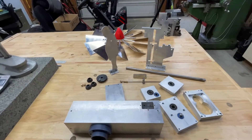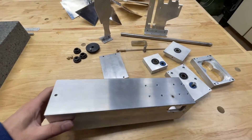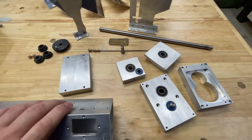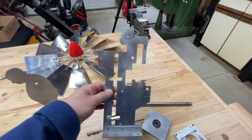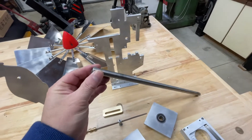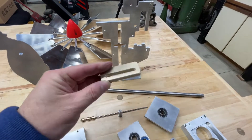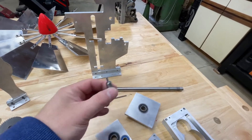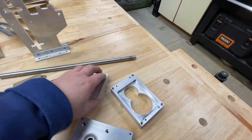I've made some progress on the project. These are some of the parts that I've finished already. Here's the main body of the whirligig — you can see all the machining holes. That's just a plastic mockup for the base, but I've got the main cutout done. I've already installed the bushing for the drive shaft. The operator is done already. The machine is almost done — a little bit of cleanup work and filing to do on that. The main shaft is just stainless steel shafting that's close tolerance, so I didn't really have to do anything with that. The bronze yoke mechanism — I'll show you in a future video how that all works and how it translates motion. I've got the right gears that I need, some of the smaller shafts already completed, the end caps, and the rear gearbox and all that that's going to be required. It's coming along pretty good.